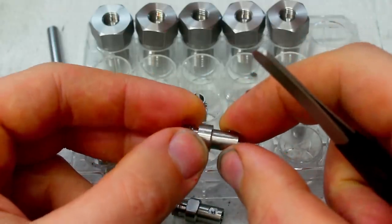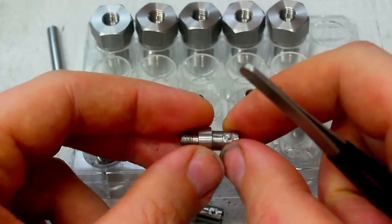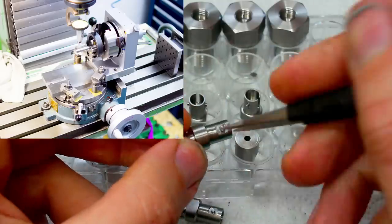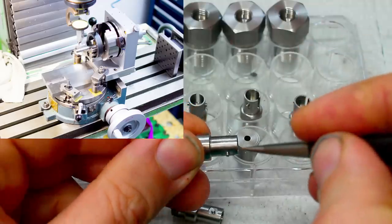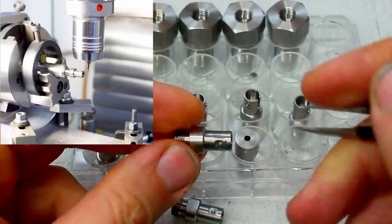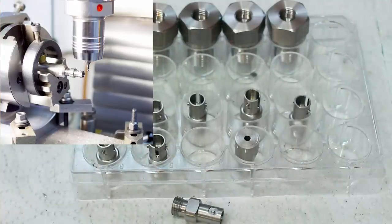And the setup itself was also quite terrible. I have a picture of the rotary table with the punch grinding fixture on top. I'm using the large rotary table to do the rotary milling of the pin feature and the punch milling fixture to do this orientation to remove the material in between the pins. As I said, really a terrible setup overall.